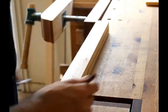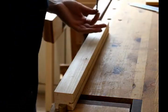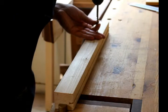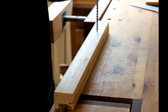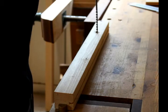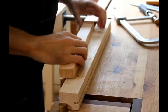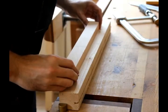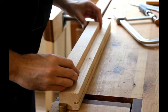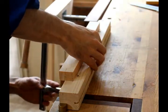I then take a quarter-inch bit and brace and I drill pilot holes at both ends. Once that's done, I take a straight edge — usually a piece of wood that has been planed straight — and I line it up with the edge of the dado that I want to cut. I then fasten it to the bench with a big clamp.